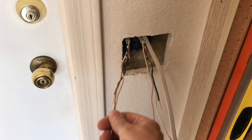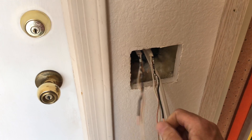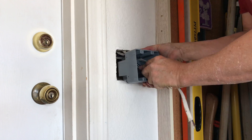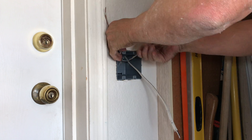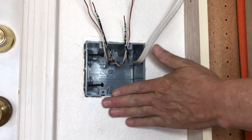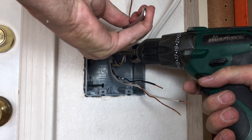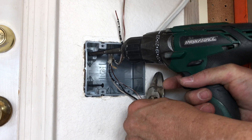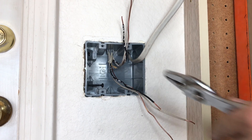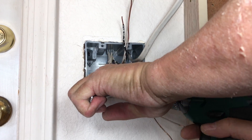Now I've got the two wires that were originally in the box: the line power coming to the switch, and the load going to the garage lights on the outside. And then this is the new wire I just installed, going across the ceiling over to where I'll put my new lights. This particular box sits flush with the outside surface of the sheetrock. I'll hold it in the right spot with pliers while I put that screw in.